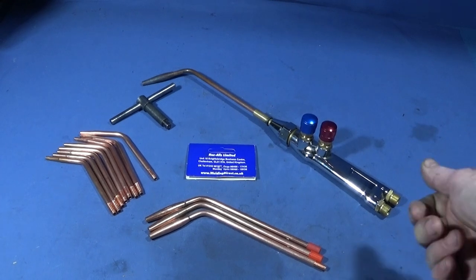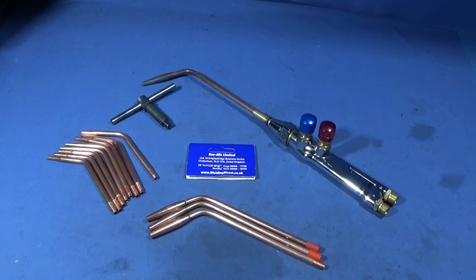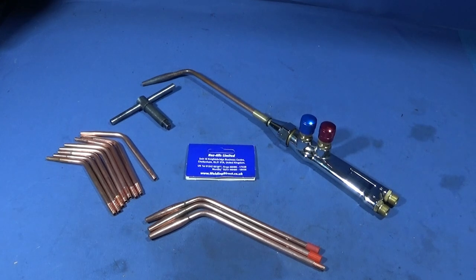And on that page it says the company made these nozzles because of popular demand, and they developed a range of nozzles with sizes that have been formulated to flow at the same rate as the acetylene versions. And this means a size 1 is still a size 1. Because of this, the larger propane tips have an additional piece added to them.